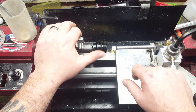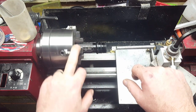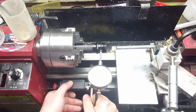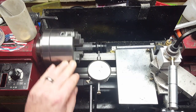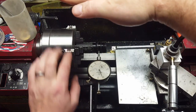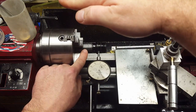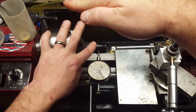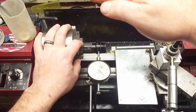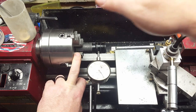What I have here is a flashlight that means a lot to me. It's a Surefire — I believe it's a 6P — that I have chucked up. Before I get broken away from this, I do believe I have it right there within a thou. Back here, two-point to two-point, within half a thou. Here it's half a thou. So I've got it square. Inside this chuck, it fits just so.